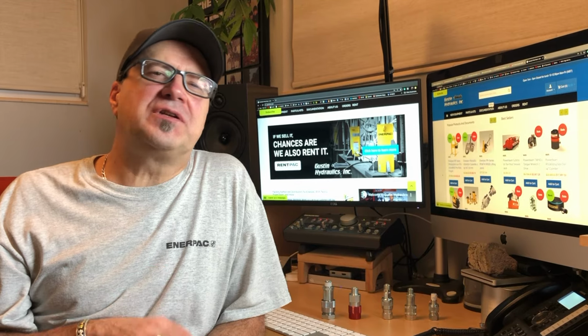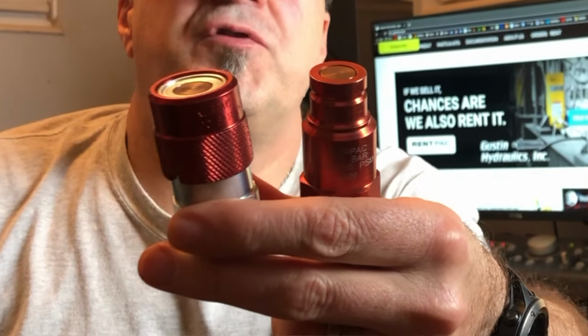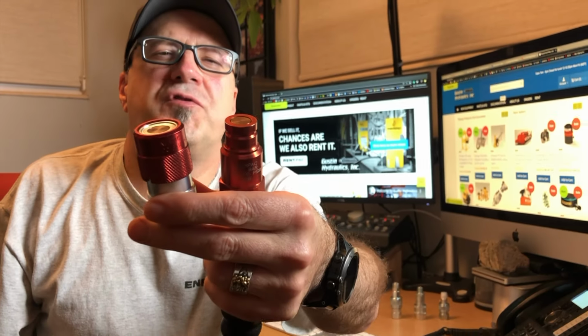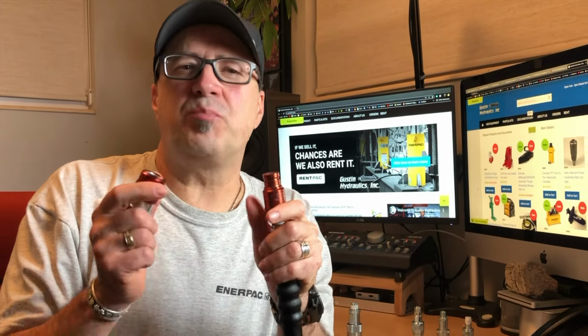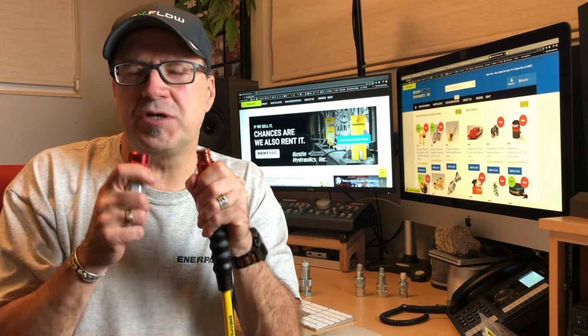later advancements in couplers, the very useful dripless, also known as flat face couplers. These are referred to as dripless because they are much less likely to drip compared to other couplers, thanks to what you could call a piston or a plunger inside each half of the coupler that's sealed with an O-ring. That's a really great feature to have when avoiding spillage is important.